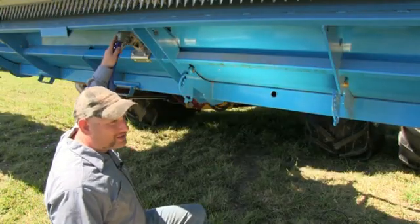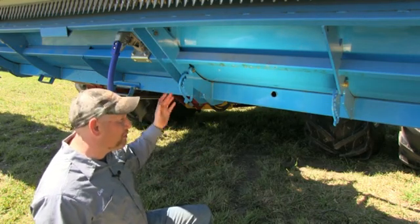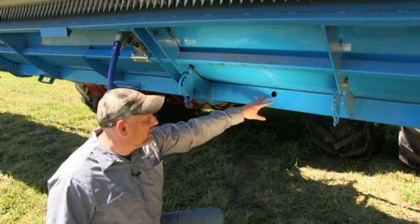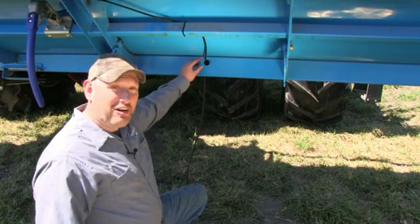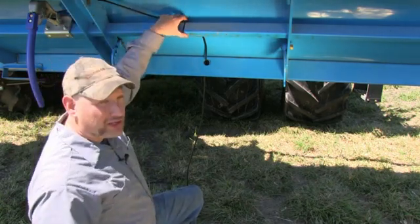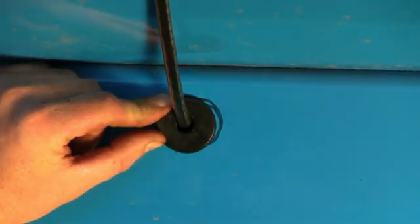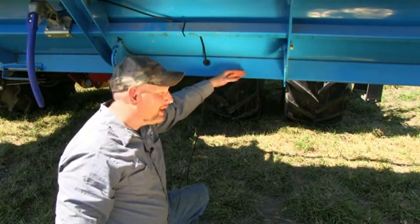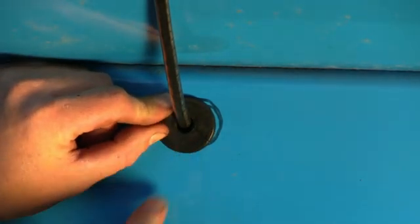We're ready to start our wiring for our center sensors now. We locate the closest skid plate to the sensor — we removed the skid plate so you could see what we were doing here. We took a quarter-inch bit, drilled a pilot hole in the back tube in the center of the skid plate, then enlarged it with an inch-and-three-quarter hole saw, which we provide in the kit. Fish the wiring through both holes and up along the top of this channel to the sensor, securing it to the sensor and with two zip ties in the center of the skid plate. Install the grommet in the hole to protect the wiring from the metal. Note that wheat stubble runs here, so this is a war zone that can destroy the wiring — it's very key to keep the wiring up and out of the war zone. On the rear of the header, we also have to install the grommet in the large hole to protect the wiring.